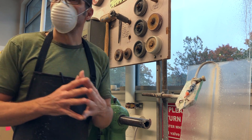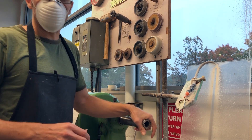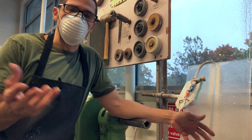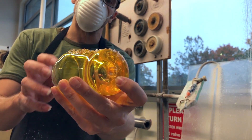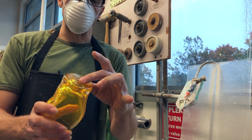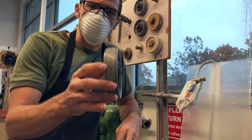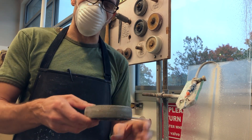Hi, let's talk about how to use the grinding lathe. This is a Merker lathe and is primarily used for engraving, but we use it in the glassblowing world oftentimes for removing punties that protrude from the bottom a little bit too much. I had a failed attempt to torch a punty and push it in — it didn't push in enough because the bottom is too thick, so now I'm going to grind this away using these wheels called spherical miracle wheels. They're available from several suppliers, but His Glassworks is the main place to get them in the United States.